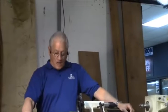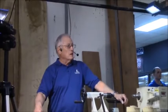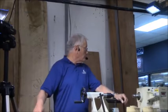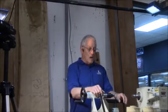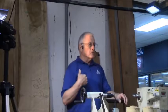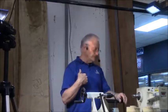Okay, again, a lot of you have seen my work. The way I look at it, there's two kinds of wood that we wind up working with. There's a lot of guys here that work with seasoned wood. We've seen some of that here. Wood that is kiln dried, et cetera, so stability and things like that you don't have to worry about. Then there's also the greenwood turners, and I fall into the greenwood category. I try to get things on the lathe when they're dripping wet.